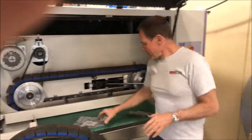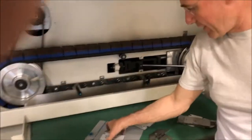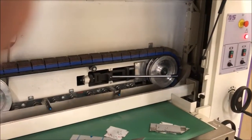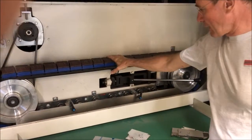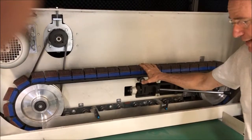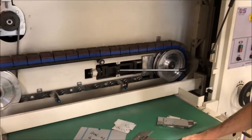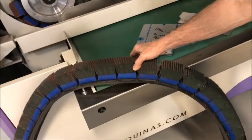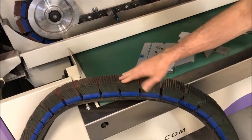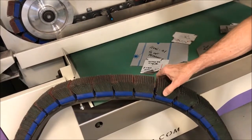So, good morning. We have a very quick test for some stainless steel parts, very good laser cut. We want to really show you two things on the machine. We have a solid block here, pure abrasive, that we're going to run the samples, probably somewhere between 2 and 4 feet per minute. And then we have our traditional abrasive, the sandpaper, the media with Scotch-Brite media alternating.